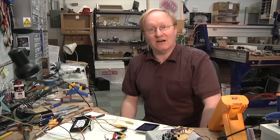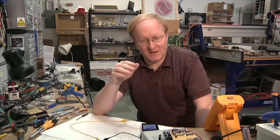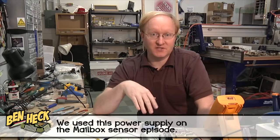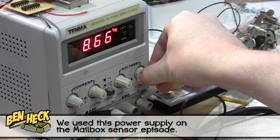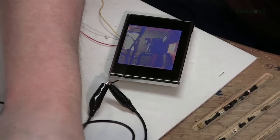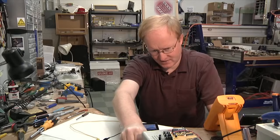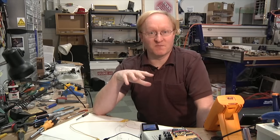Let's use the other bench power supply and see how low we can go. I have my other bench power supply hooked up to it now; I can vary the voltage. I'm going to start at 12 and work my way down and see what the minimum voltage is to run this screen. Heading it down — 7.96, still on. There it goes — dies at about 6. So if we use that 7.4 volt lithium-ion battery, we should be okay.